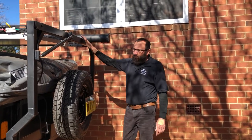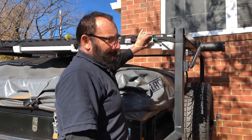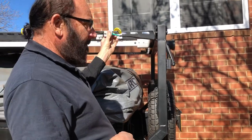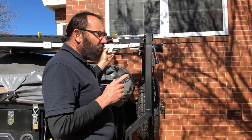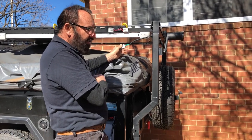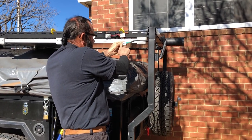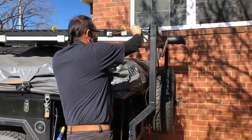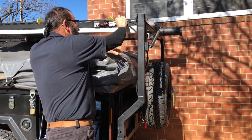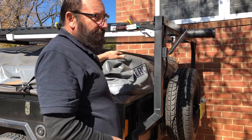Before I do that, I just want to show you something here — Anderson plugs. You can hook these up without worrying about positive and negative because if you hook them up the wrong way, you'll get a short, blow something up, or worse, destroy that regulator that controls everything. Negative is at the top and positive is at the bottom — that's the only way they'll go together. If you try to turn them around, they will not connect. It's just impossible.